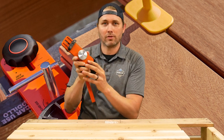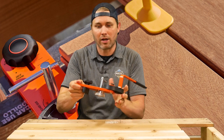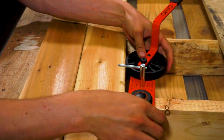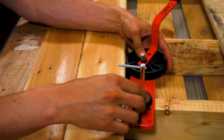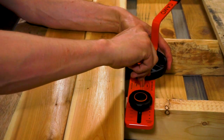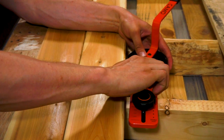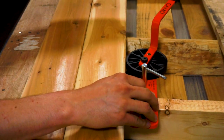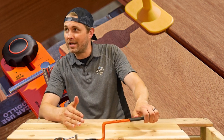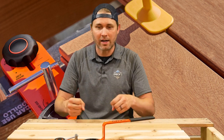This little cam at the bottom here allows you to lock onto that joist to get ready to bend your board. So let's say that this cedar is a bit crooked or that we're using clips with it — we want to make sure it's tight. We're going to position it over the joist and turn this little cam here to lock it in place. And once we've done that, all we have to do is take this other handle here and turn that in. You can hear it squeezing that board into place, and that'll lock itself once you get it tightened enough.